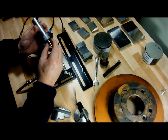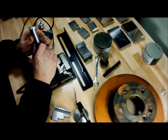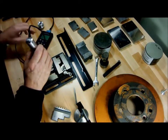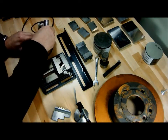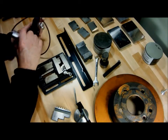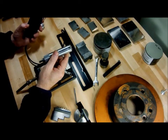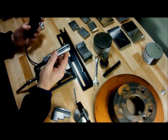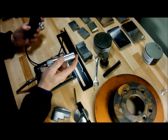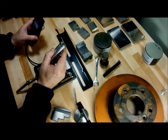So about plus or minus two or less for Rockwell — very, very good unit. One of its beauties is that it has an automatic timeout. It has a great range of testing. A limit it does have is that it's not much good for non-ferrous materials like aluminums, brass, copper — materials that a rebound tester might be good for.